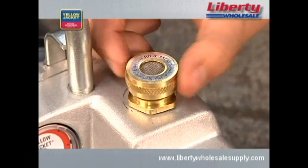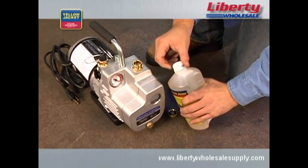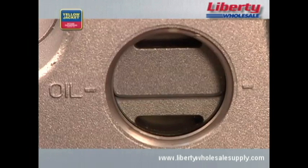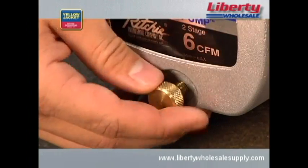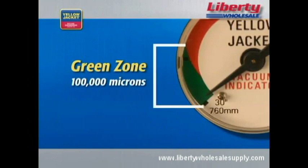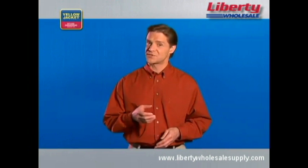One feature that you'll find useful is a large diameter oil fill port — it makes adding oil easy and minimizes the risk of making a mess. It's important to be able to gauge how full the pump is when adding oil, so make sure your pump has an easy-to-read sight glass. Another seemingly simple feature is the oil drain plug — look for a large opening, which will allow for quick oil drainage, meaning you get your jobs done faster. Some pumps also come equipped with a vacuum gauge indicator, which will give you a coarse view of the vacuum being pulled. This one has a green zone, which corresponds to about 100,000 microns. If your pump can't pull into the green zone, then it's likely that you still have a leak.